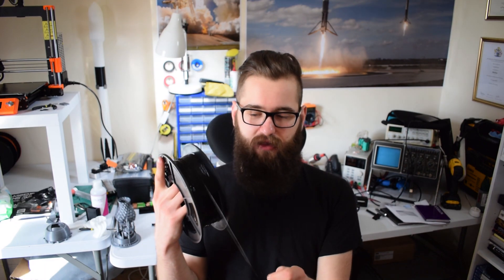I didn't think too much of it at first. I just put it on the spool holder, fed the filament through, and started printing. But pretty quickly I noticed my printer was making some horrible noises. Luckily I caught on to it fast and no damage really occurred. What was happening was the extruder was trying to pull the filament through but really struggling — it was sort of woven between each other and jammed underneath some of the other loops. You can hear when you pull it, it makes nasty crunching sounds, and my extruder was making horrible clicking sounds.